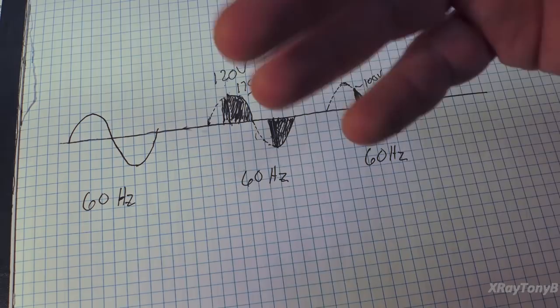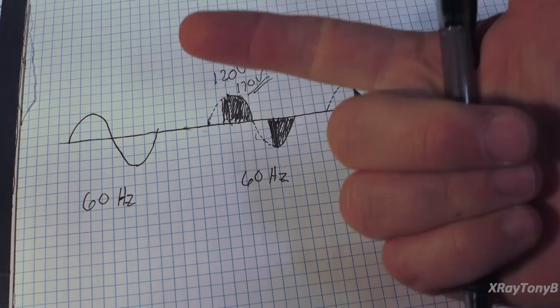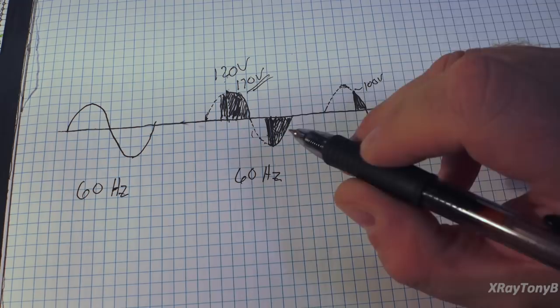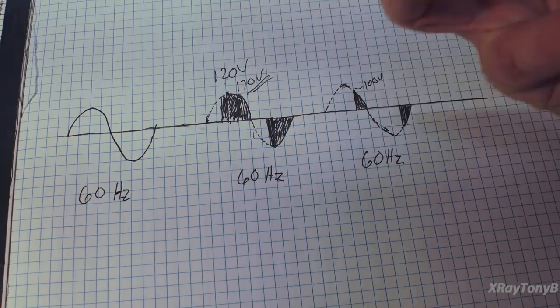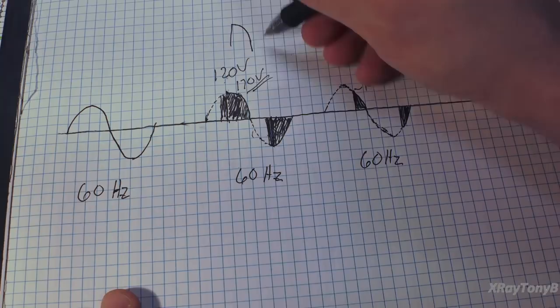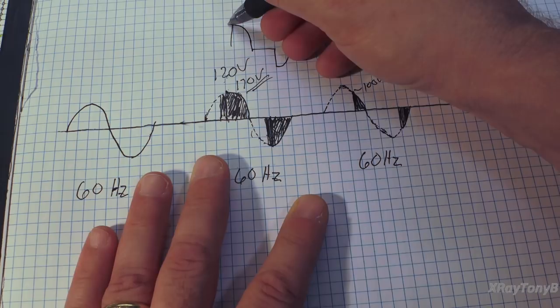If the components are in good condition and properly adjusted, this circuit works very well. If you noticed from the last video, as I increased the volume on the amplifier and it started demanding more current from the power supply, you'd see that line on the oscilloscope creep over further and further as we turned the volume up. The TRIAC was firing closer and closer to the peak. That's what was happening - it controls when to turn this on.